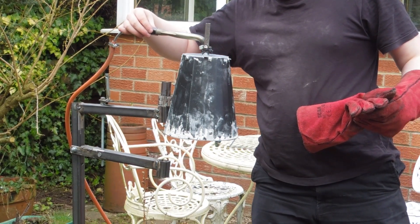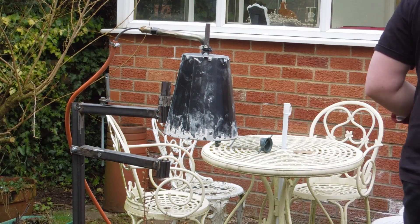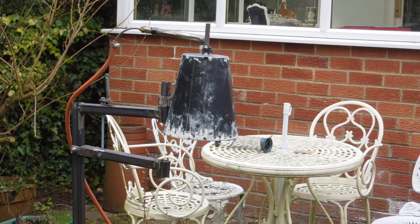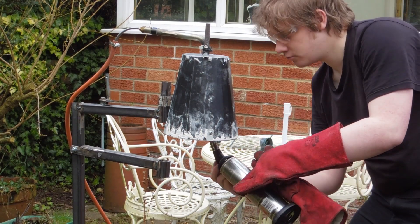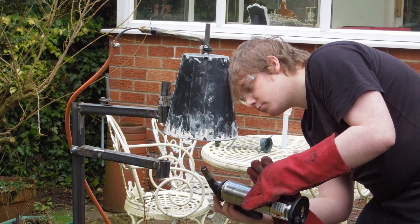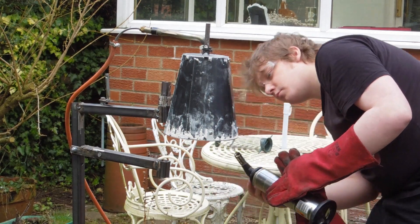It took a while to get a good setting for the burner — too low and any gust of wind would snuff the flame, too high and it felt like wasting a lot of gas and maybe heating the refractory too fast. My blowtorch also chose a great moment to pack in, but the spark was enough to relight the forge.